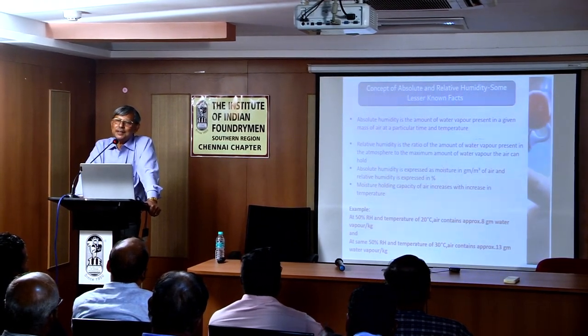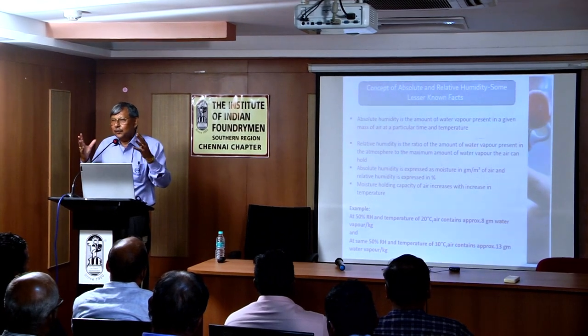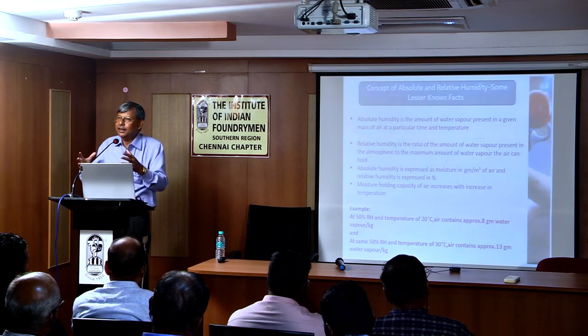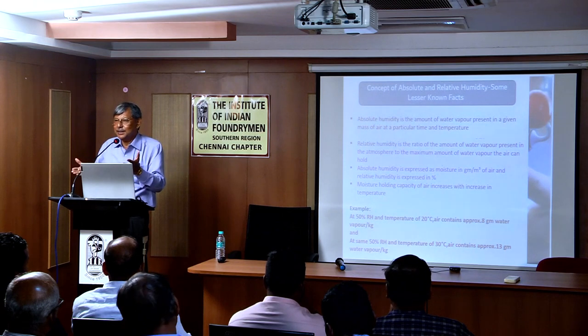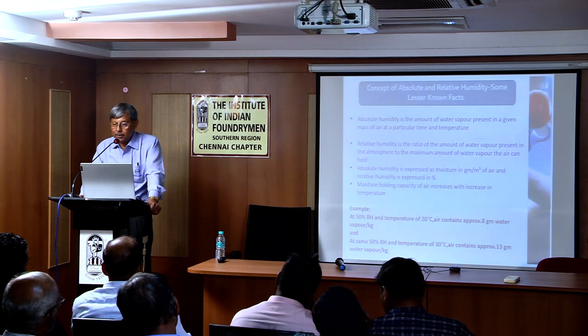So which is more detrimental? More detrimental is 30 degree centigrade, because although humidity is 50%, the moisture carrying capacity of the air is much more. It is almost double what it is at 20 degree centigrade. There is a calculation, you can find out, I have done it.